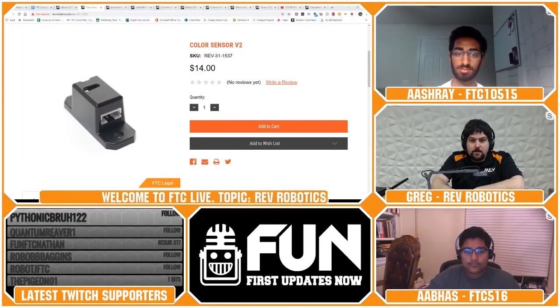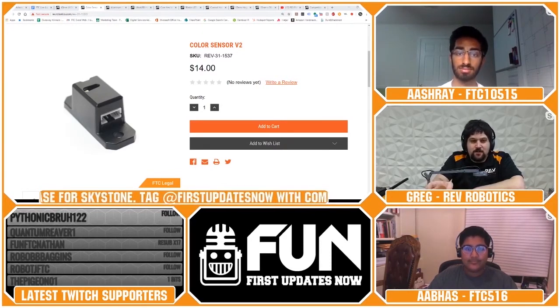David Recharged asks: what is the color sensor V3? The color sensor V3 is the next iteration of our color sensor. If you have our V1 or V2, it works pretty much the same. The electronic component used in the V2 got discontinued — we learned this about 18 months ago, bought a lot of those parts to extend availability, but we finally ran out. The V3 is the natural evolution. You can treat V2 and V3 almost the same, but it does require running the latest FTC SDK and selecting color sensor V3 due to a software change. From a reliability standpoint, it's the same color sensor with similar performance.